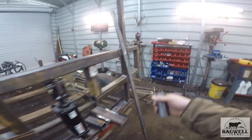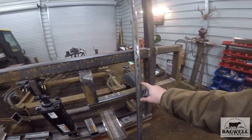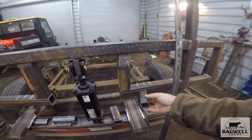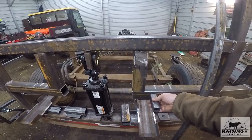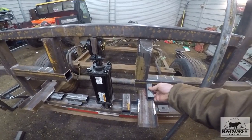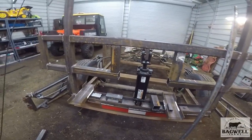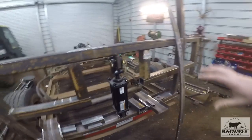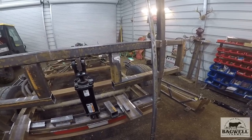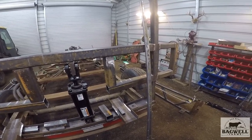I went ahead and got a piece of inch-and-a-quarter tubing to mount across the back to put the nozzles on, because this is two-and-a-half inch - I'm not going to make clamps for that. It was just easier to get a stick of inch-and-a-quarter. I made little four-inch extensions so that'll give me enough room once I get my channel on for it to clear and still put nozzles on. It'll also kick it out far enough past the actual frame of the sprayer to make sure that on a windy day, the nozzles still have enough clearance for the spray to reach the ground without blowing it back into the sprayer.